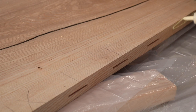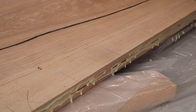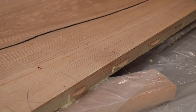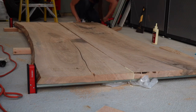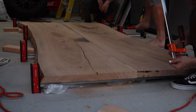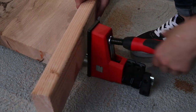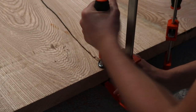I really love using DAP Carpenters glue for pretty much every project, so I figured I'd try it here. I added an ample amount of glue, spread it evenly on both sides I was joining, put the biscuits in their slots, and then added even more glue on top. I then pressed the biscuits into each slot and began the clamping process. It was a little stressful because it was really warm out and the slabs were so big, so I called in a couple of extra hands to help ensure clamping pressure on all the necessary parts. Clamping the live edge was a little strange — I could have made custom jigs but didn't think of it beforehand, so I added a couple of 2x4s in between some of the clamps to help with the pressure, and it worked really well.